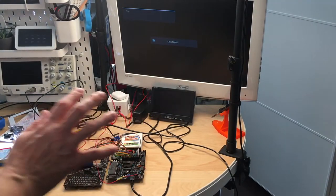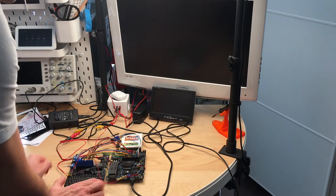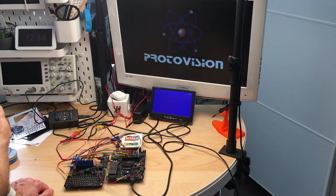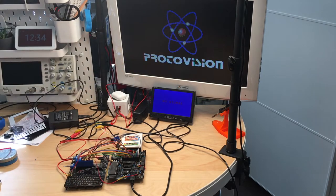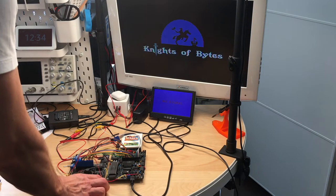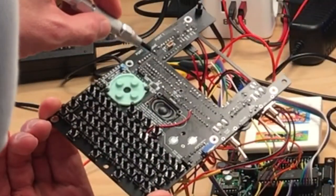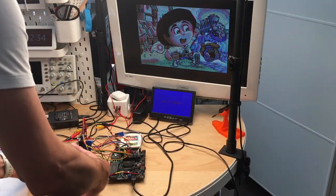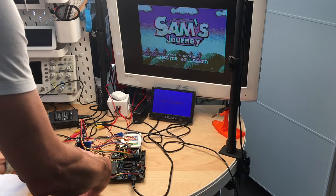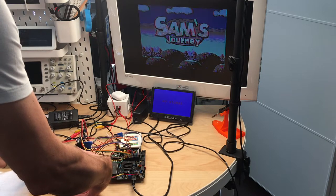Okay, I have to give you a little wider angle here. So if I switch on the machine and this monitor is now connected, then you can see that the S-video goes into the TV, which works fine, and the composite should show up over there on the screen, but it says no signal. So that made me think that there is actually a trim over on this side which says video sync fixed trim. So why don't we try that out? Because it has to be a sync problem, because I can see that the monitor tries to get something,